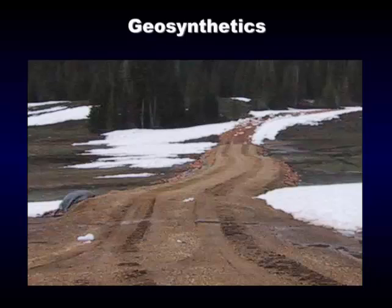We used the same fabric on the big slump I showed earlier where the road had actually fallen. If you're going to use fabric, get more information if you're not already familiar with it — we use it quite a bit; Kerry and Darren can help out with that. It's relatively expensive but not too bad, and you can do a lot with it. You can hold water down and drive across it, or use it to hold material from getting down into big rocks, which would otherwise just plug off. Now the water actually flows through that road without a culvert and keeps the whole wet area in its riparian stage rather than drying it all up.